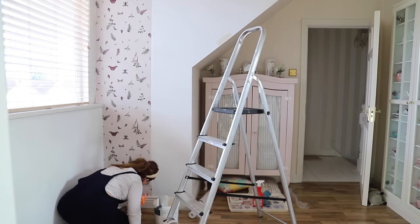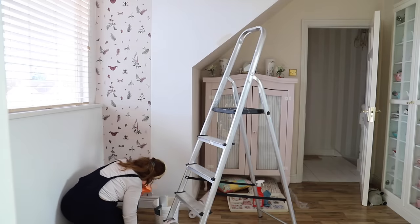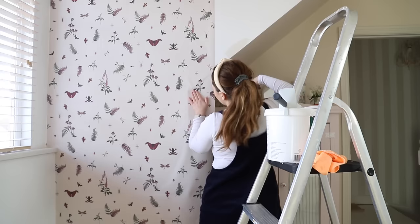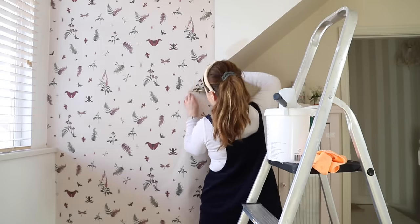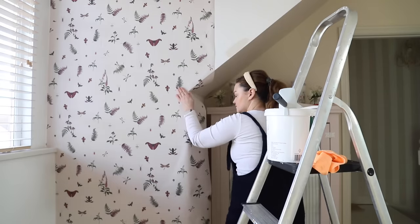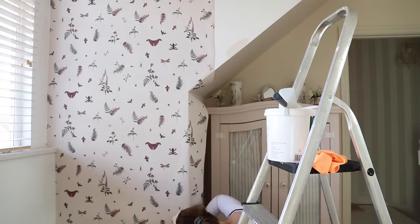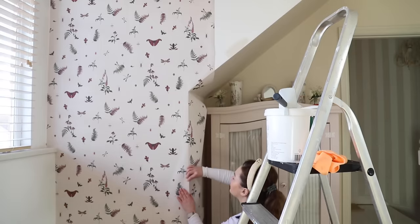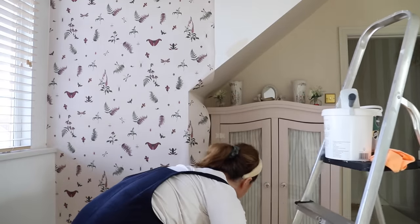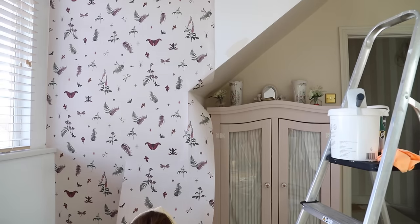And I think a lot of us, including me, have a bit of fear of wallpapering because you just think of, oh, I have to get a wallpaper table out. I have to put the paper on the table and it's rolling back up. It feels like it could be a messy job. I find the paste-the-wall wallpaper is easier. I don't have to use a wallpapering table. I just make sure the floor is clean and that's long enough for me to roll out the piece of wallpaper and then cut off and get it ready to be put on the wall.